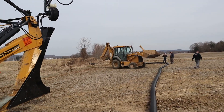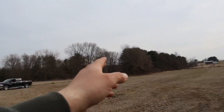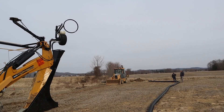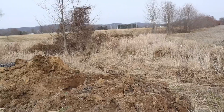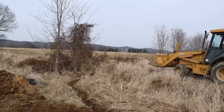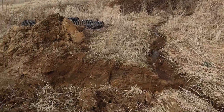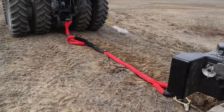When we were getting ready to start putting this pipe in, we realized the ditch is not deep enough at the outlet, so dad is going to dig it out a little bit. This whole ditch system does need cleaned out, including the one on the other side of the hoe, but we haven't got to it yet. With our surveying, we could see how much depth we needed — when we put the plow into the hole he dug out, we were 20 inches off. We've got to dig it out quite a bit.